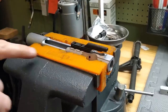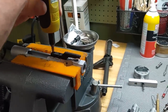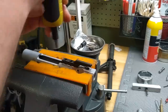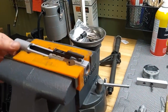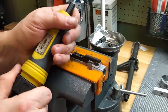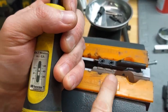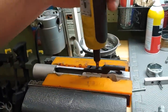These are the ones with the YFS fasteners. No movement. That's four that passed. No movement. So all five passed my reverse torque test. Let's go ahead, since we're going to tear them off, let's see what they can endure. Let's go up to 40. Normally, ones that are installed with the proper amount of torque and have sufficient staking will usually break loose at about 45 to 50 inch-pounds on this type of wrench in reverse.